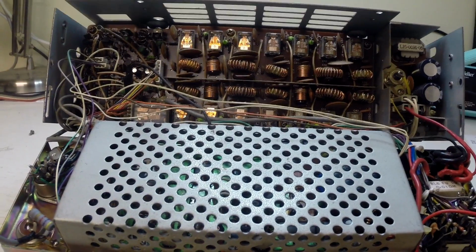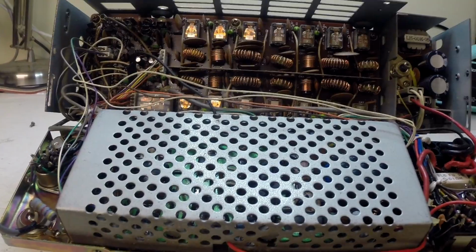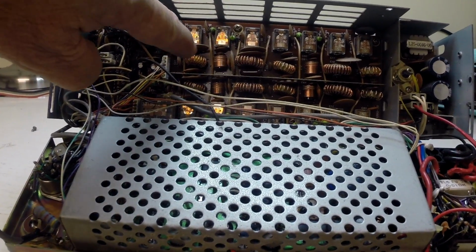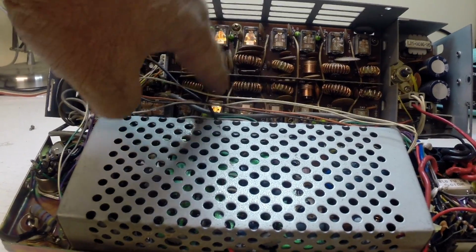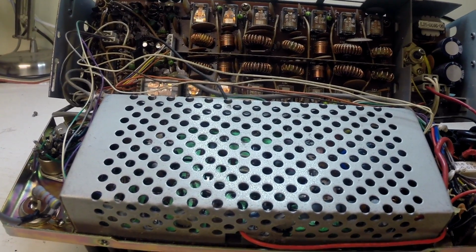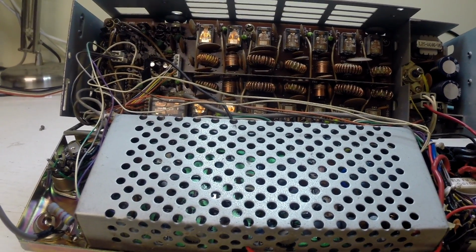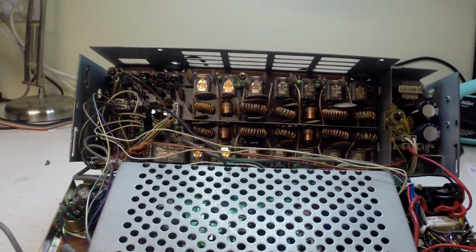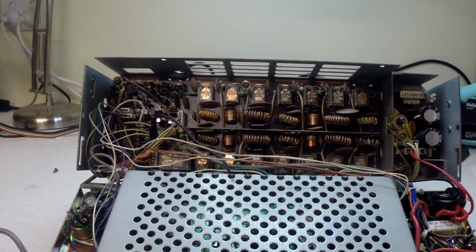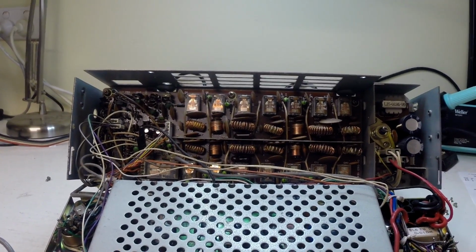So a frequency range, say from 4 megs to 8 megs, may be very desensitized, and it would be simply that the relay that covers that filter is the problem. Alright, we're going to try and get the covers off those, have a look and see how easy they are to clean. It will probably be just a bit of contact cleaner, and if we can get a bit of shiny paper in there and give them a bit of a wipe. Alright, let's press on.